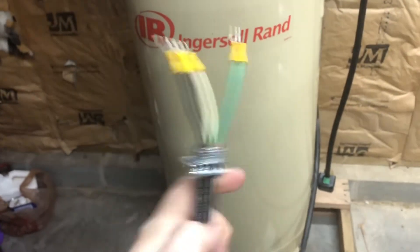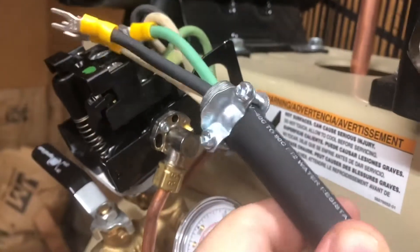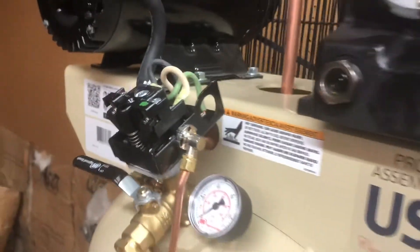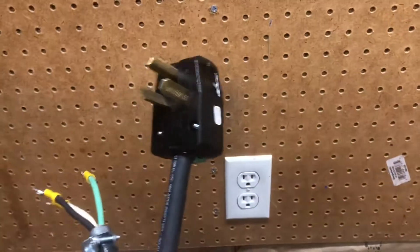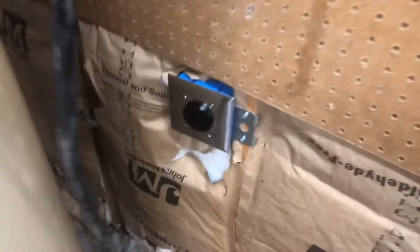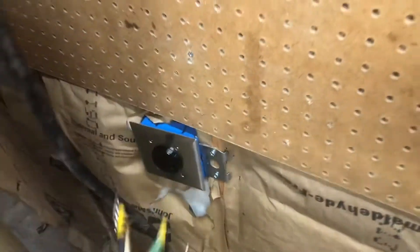You're going to need a wire clamp, because this is what holds it into the box — the wires get threaded through that hole and the clamp keeps it from being pulled out, so there's no stress on your connections. The other thing you'll need is a matching plug. I went with a 50 amp rated one that matches my style of receptacle. You can see the ground is facing up so that when it's plugged in, the wire weight comes down with gravity and isn't inverted — keep that in mind.